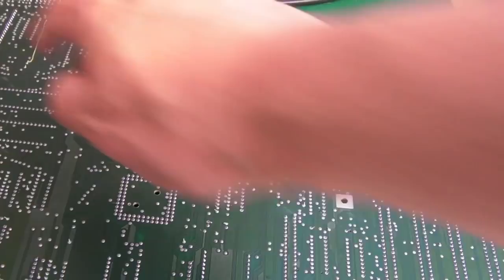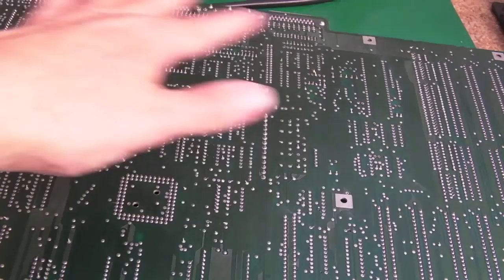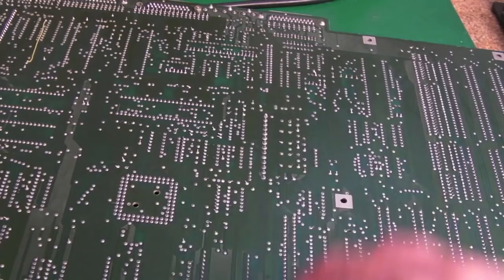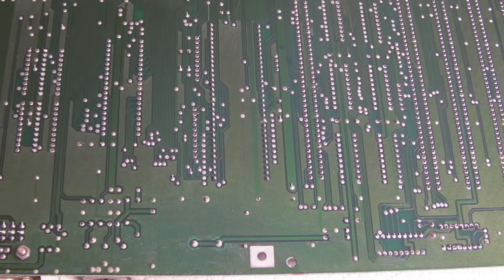I had to use my scratchy tool to scratch off a creamy white ring around anything where there's been flux — the remnants of the flux had gone weird from the alkaline effect. It took an incredible amount of time. That white chalky appearance was really hard to get off. I cleaned it with IPA and it got worse — the whole board went white — but then I just got the brush on here and it brushed straight off. It was like a chalky powder left after the IPA, and as you can see it seems to have done the job.